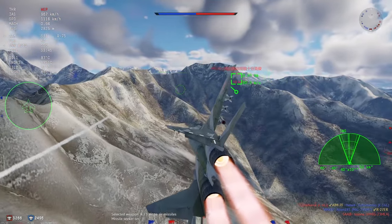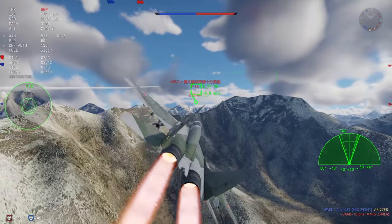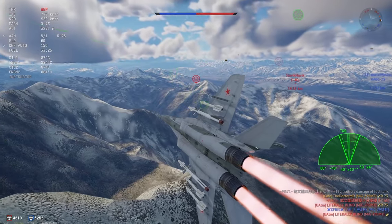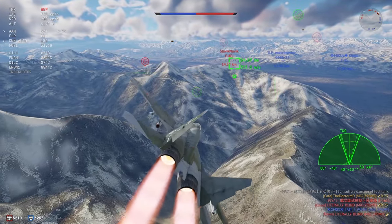the AESA radar signal. Furthermore, the AESA can also switch into a receive-only mode, which can receive jamming and radar signals from external sources without sending radar signals itself, allowing it to detect targets without revealing its own position.